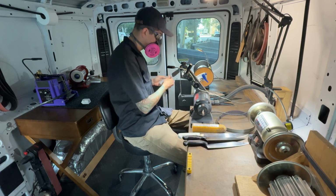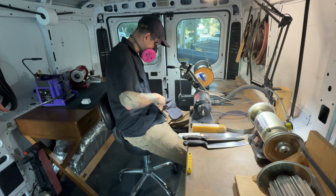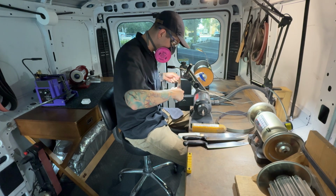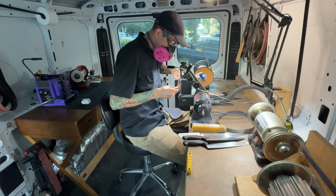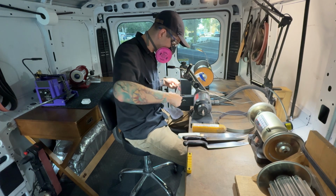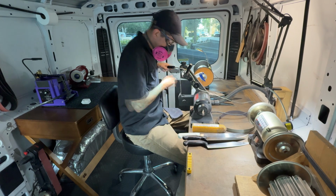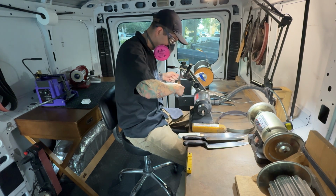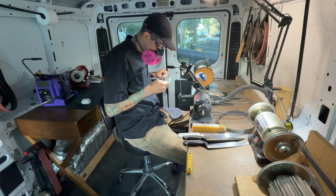That's also not a good idea because you're going to build up unnecessary heat in the blade. So I find that's one good way of going about that is to just do 1 or 2 passes at an extremely high angle and just kind of blast away that damage as quickly as possible. And then you have a clean slate to work with, establishing your final edge angle.